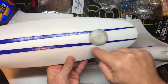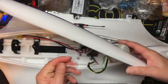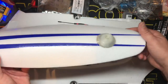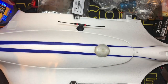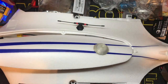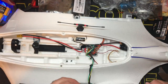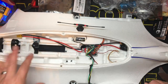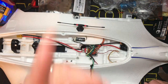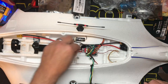We also routered a hole into the foam, put the GPS dome on top — this will be glowing whatever color at the time. I made the hole a little bit bigger because I messed up, but that's okay — I just filled it up with hot glue, hot glued this in, and it's perfect. We did rotate the flight controller negative 90 degrees, and we will have to change that in iNav, because I want the SD card and the USB accessible.